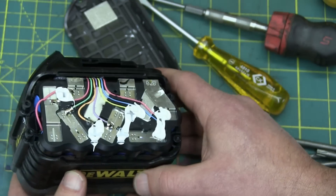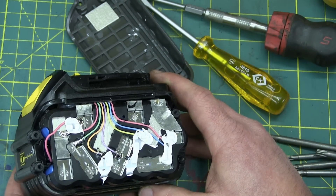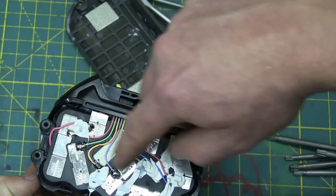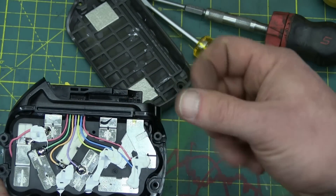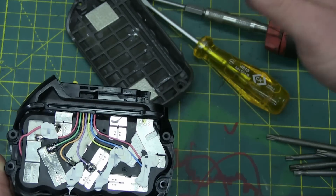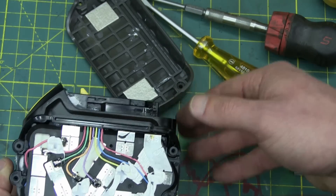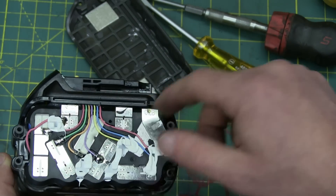That's interesting — I would have thought it would be banks, three banks like this. Also, 60 volts: if you've got sweaty skin, you'll feel it. The welder open circuit is around 50 volts and if you've got wet gloves or anything, it lights you up like a Christmas tree. So just be careful around this.